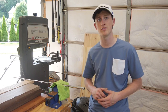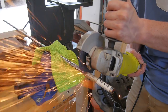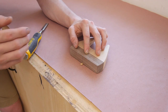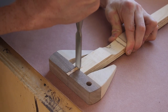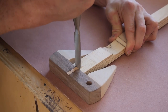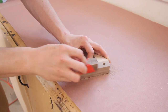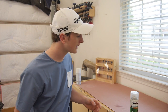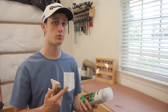While I wait for my piece of inlay to dry, I'm going to cut the putter shaft down to about 35 inches long. Now that the wood glue is set up, I can go ahead and cut off the excess inlay. After sanding my putter head down to a nice smooth finish for the final time, I can apply a clear coat. For that I chose this water-resistant spar urethane — it works great on outdoor projects, so I'm using it on the putter head to protect it from the elements.